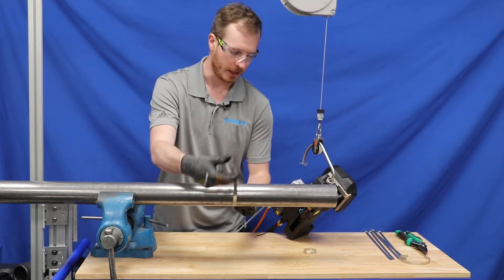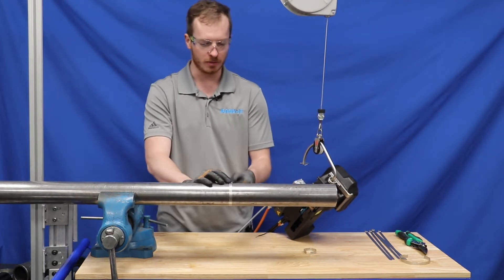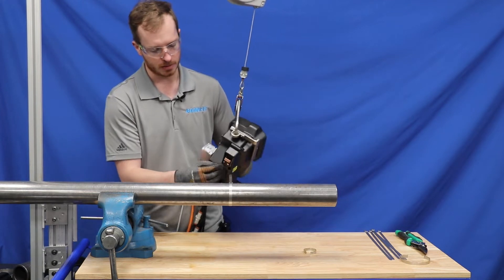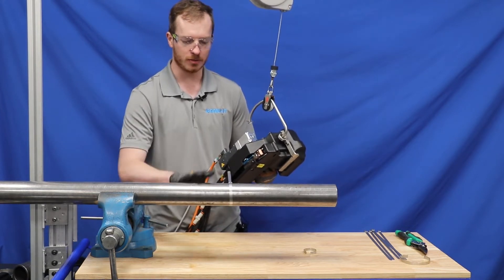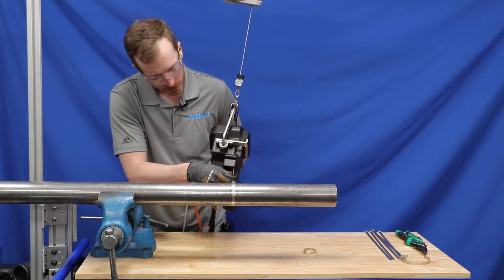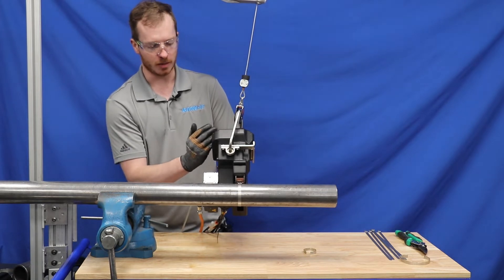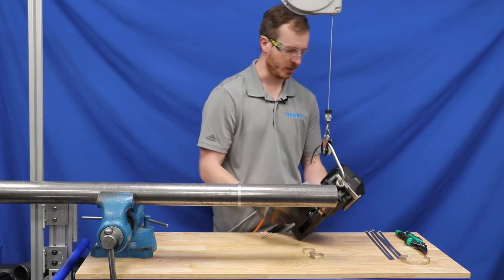This tool also has proximity sensors that verify that the clamp is in the correct location. As you are installing, these sensors are sensing the workpiece and the buckle to ensure that it is tangent against the workpiece. You will notice this because when installing a clamp, if you lean back on it, it won't activate until the clamp is tangent to the workpiece.